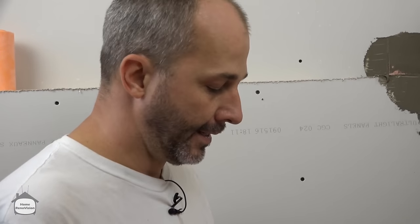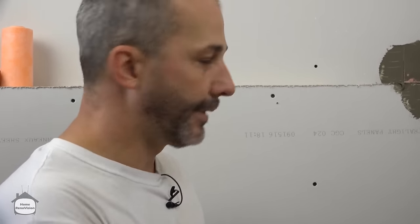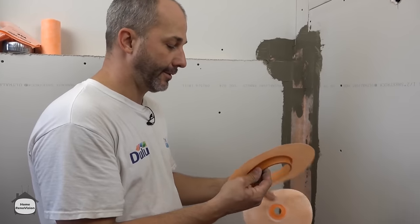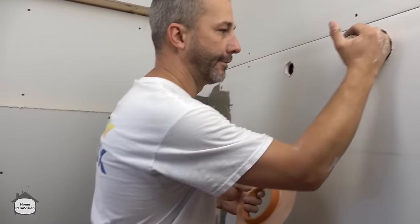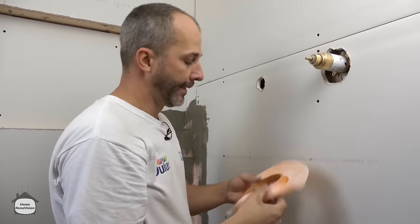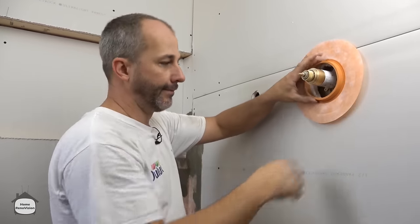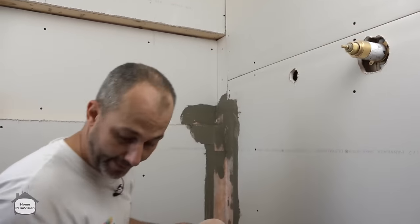In the Schluter system, whenever you buy a floor shower pan package, you get inside outside corners for the shower pan. You also get these little gizmos. These are awesome. If you can use them, they're great little additions to your toolbox. The idea here is a lot of shower valves they come with a round housing, just a simple cylinder, a couple mounting screws, and then a round plate or a square plate, and they've got a gasket. You don't really need a waterproofing gasket, but if it fits, and you can make sure that you have a nice joint, and a little something to divert the water so it can drain back out from underneath, if it gets there, then why the heck not?